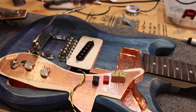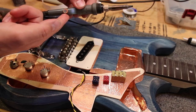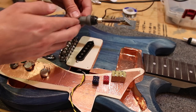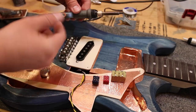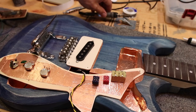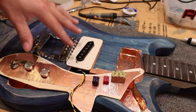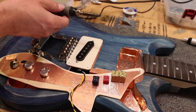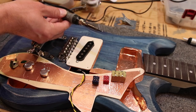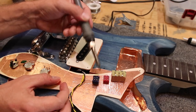I highly recommend this soldering iron — it's got a temperature gauge on it. I've got my temperature set to about 400 degrees. I don't know how accurate that gauge is, but from my experience that setting on this particular one works perfectly. Now, a lot of people think that what you want to do is put some solder on your soldering iron and then wipe it onto your component. As you can see, that's not going to work very well — it kind of sort of sticks and kind of sort of doesn't. That's not the best way.